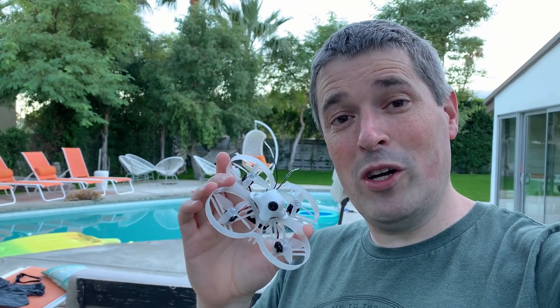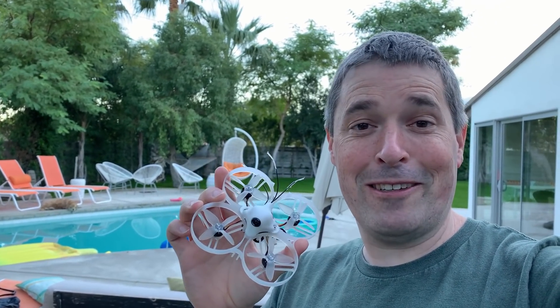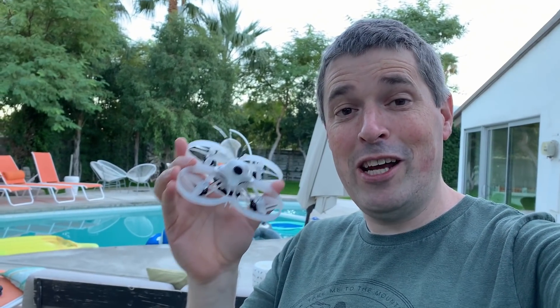The motors are really the only thing in danger of rusting out or seizing up over time. My defense for the motors is I've been keeping them well lubricated, and the way I dry things out is I just fly around really fast through the air after I'm done playing in the water. This drone is a Shutterbug 85 — that's a nickname I gave to this formula and it's still my favorite formula for a 2S whoop. It's got 1103 motors and 2-inch props. If you're interested in building one I'll put parts down in the video description. If you're going to try waterproofing any of your drones, your results may vary and you do so completely at your own risk. Please be careful because silicone conformal coating is actually really toxic — it has bad fumes, it spreads out, and it can ruin connectors — so be sure to read the safety instructions. Thanks for watching, stay safe out there, and I'll see you next time.